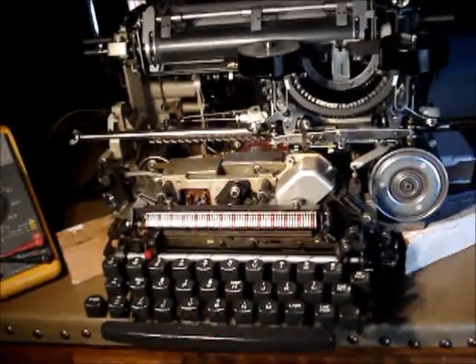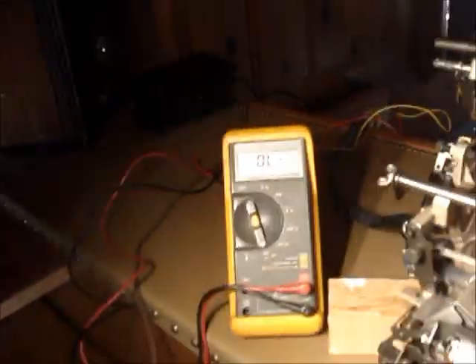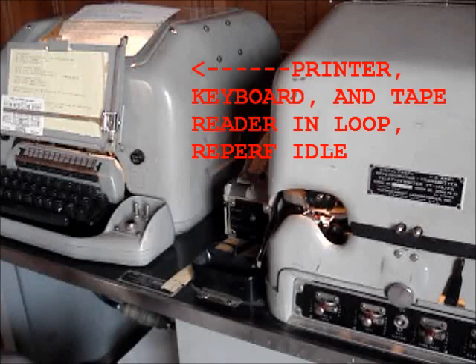I've got the keyboard reinstalled on the main printer chassis. Now that I've done that, let's do one final check. I'm going to press a key — 1.5 ohms at the end of the cable. That's great. Let's do it again — press a key: 1.5. And then release. We're good. Looks like simultaneous mode is working now, very well.